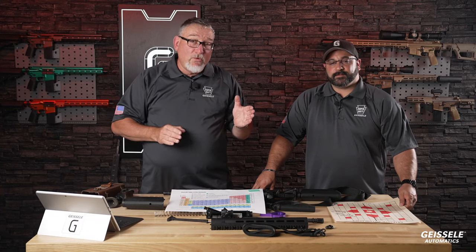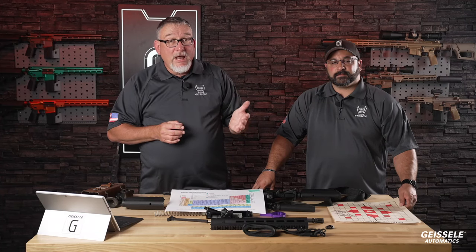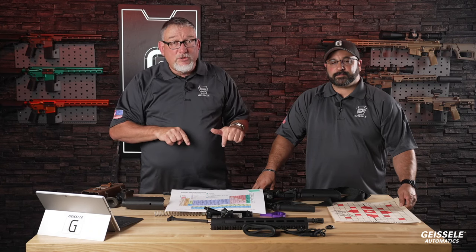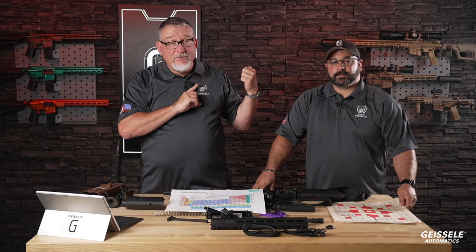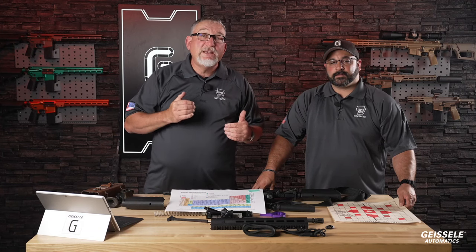You've always heard the old rifleman adage, you know, a chrome-lined barrel is less accurate than a barrel that's not chrome-lined. We've changed that, all right? This is traditional mil-spec chrome lining. You'll see other guns that we have that are probably the most accurate semi-automatic rifles built ever in our history. But this is mil-spec chrome lining. It's about 7/10 to 1/1000ths of an inch thick.